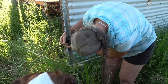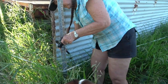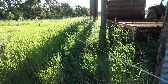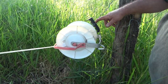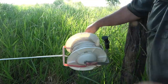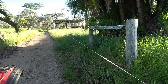It's just a matter of putting the clips on and hooking the fence through the clip, then we can turn the fence on and it should be working. This is the reel on the end and I've got it tied onto the plastic handle so it's not earthed to the ground. I'll tighten it up really tight — over this side it has a pull that stops it running back out. If any of the grass is touching the fence, it will earth the fence out, so I've got to go along and make sure none of the grass has touched the fence.